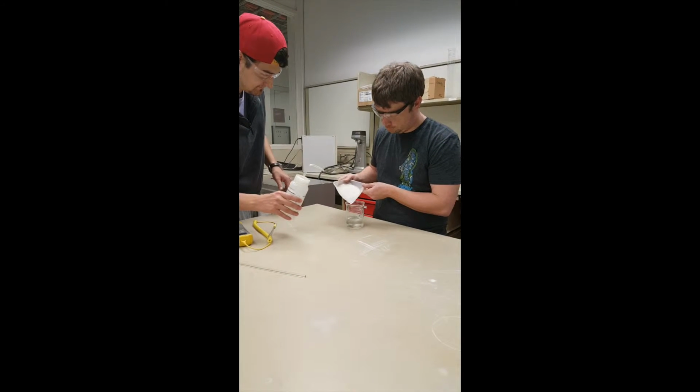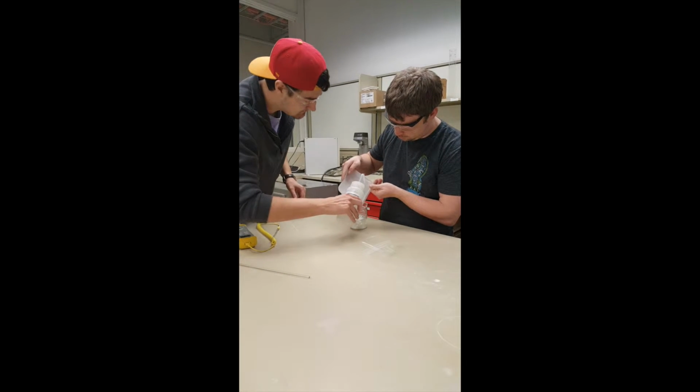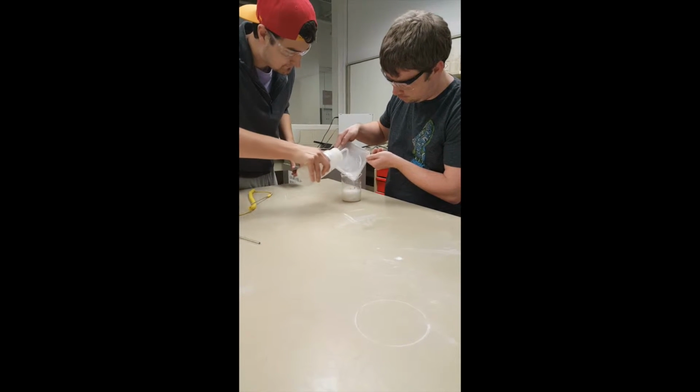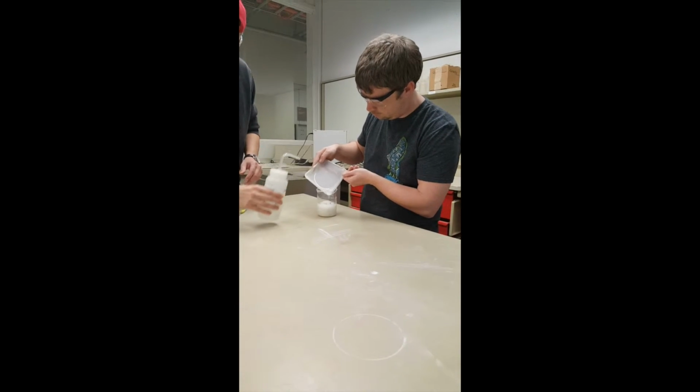Add 125 milliliters of the sodium hexametaphosphate solution to a 250 milliliter capacity beaker. Zero the scale. Transfer the particles passing the 200 sieve into the hexametaphosphate solution, making sure to add at least 15 grams. Record the mass added to the solution.